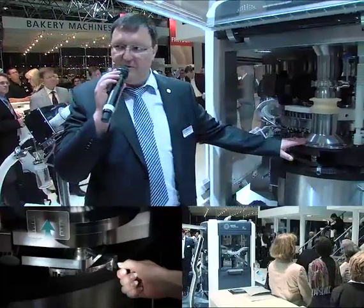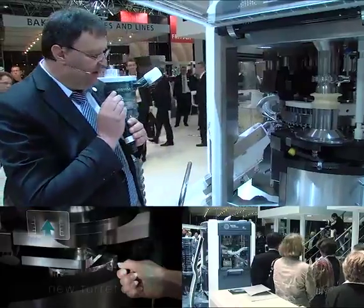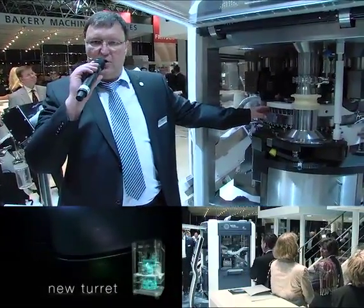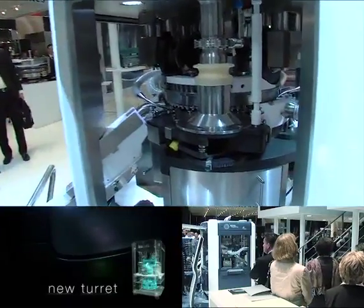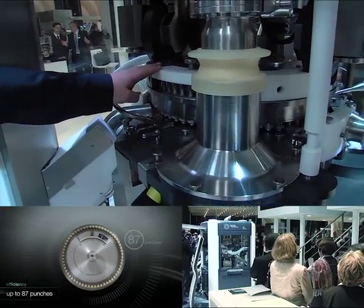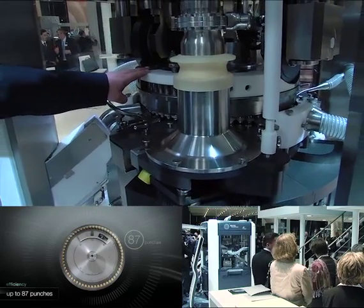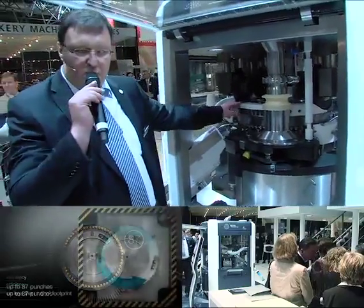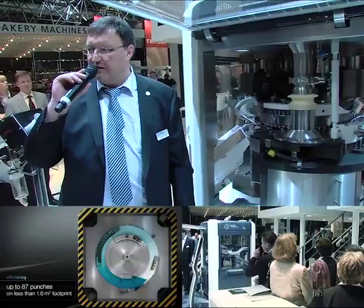With the help of this leverage, you can position the filling unit in 30 micrometer steps above the segments. So it's very easy for everyone to optimally adjust the filling unit in order to prevent product loss. Here you can also see our new rotor. The new rotor has a diameter of 550 millimeters, which is the largest rotor in a simple machine. It presses more than half a million tablets per hour, with 87 punches on 1.6 square meters.